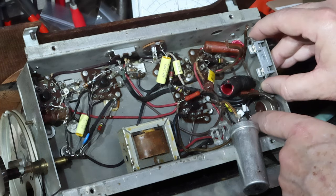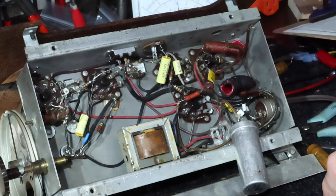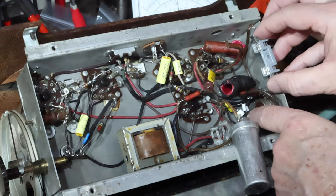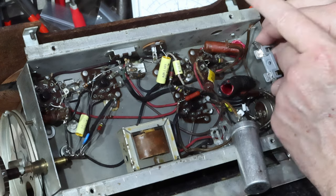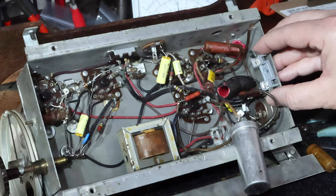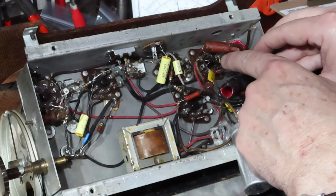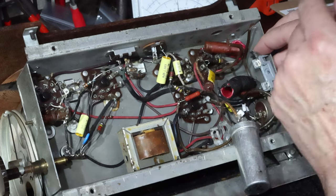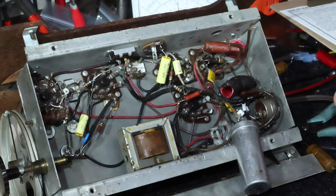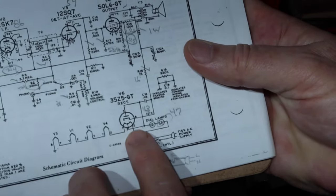Okay, from the switch outlet, I'll probably mount the thermistor. I don't think I have it out here right now. I'll mount a CL90 there. And then from there, it'll go to where the line needs to go up here, to the binding post that has both the line going into the rectifier and also to the dial lamps, which is right here.